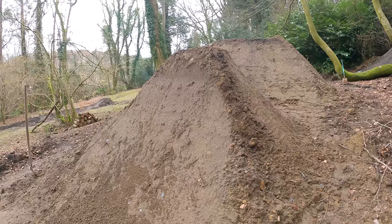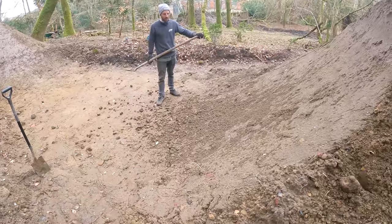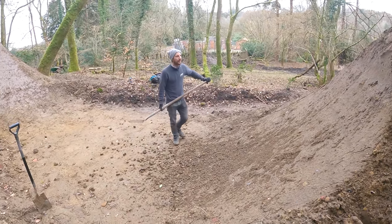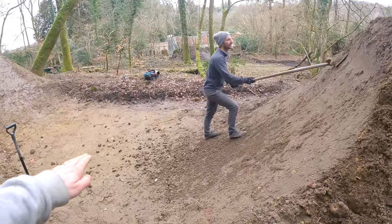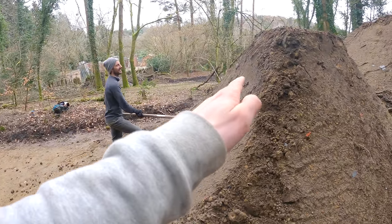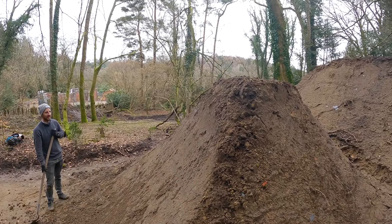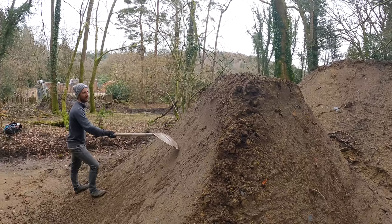So that's about the height we need, I think. Now, we need to think about the transition at the front. I always like with our takeoffs to have as perfectly circular a transition as we can, all the way up to close to the top, then for it to slow down a little bit, and then to have maybe half a bike length, so maybe half a meter to a meter of flat top.